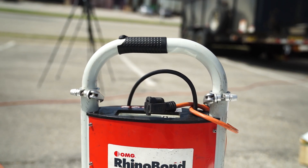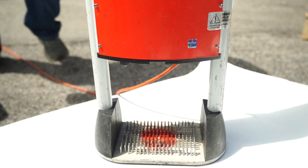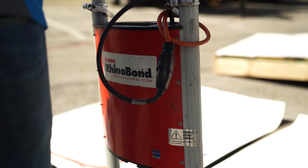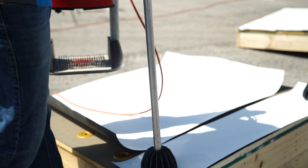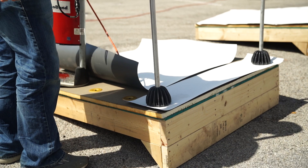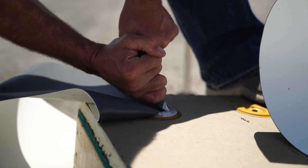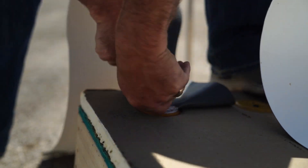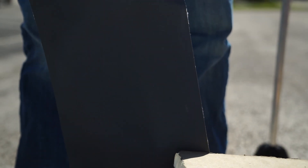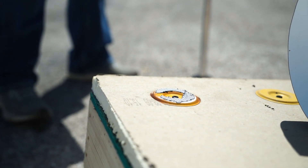The next system is the Rhino Bond attachment method. Before we can get started, we have to do an adhesion test: we put a plate and a screw into the roof, take a test piece of TPO, set it in place, set the temperature on the robot, start it, and once it beeps we put the magnet on and let it cool. Then we try to peel the TPO off that plate. We should get 360 degrees of adhesion — it should actually tear the backing off the TPO. That's how you confirm you have the right temperature before rolling across the entire roof and ending up with cold welds. It's a critical step to this roof system.